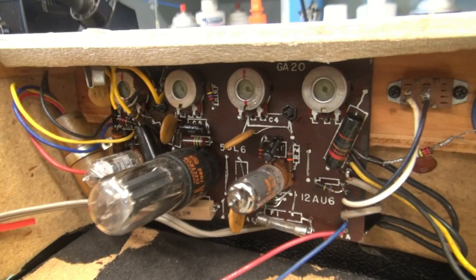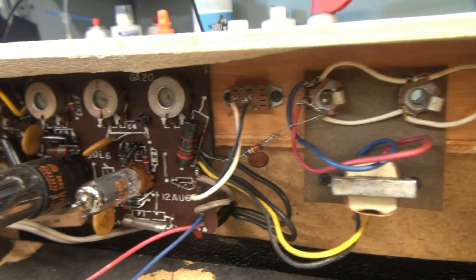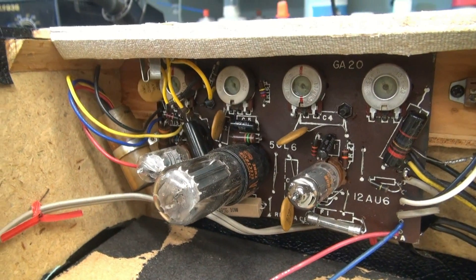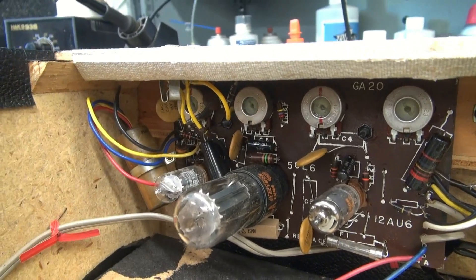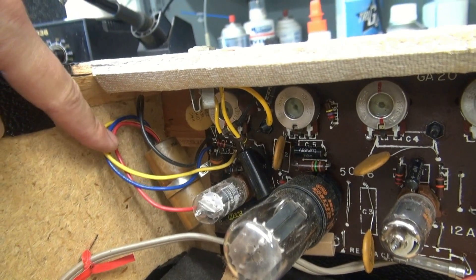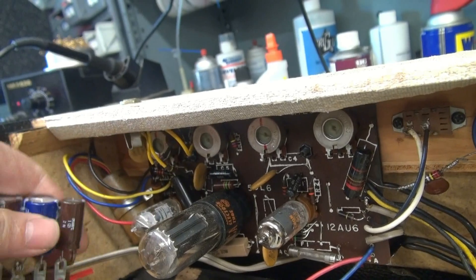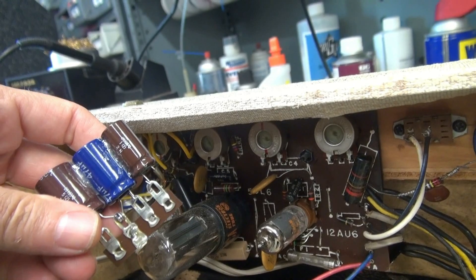Here's the circuit board the amp is built on. Unfortunately, they didn't allow for a panel to simply remove the amp and repair it — you have to actually disassemble everything. So that kind of sucks. Anyway, we're going to be changing this cap here. He's kind of loose hanging out there. Instead of using one of these old ugly three-section things, I actually built a capacitor assembly. This will screw in where that one's at, and then we'll hook those leads up to the new cap assembly.